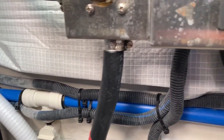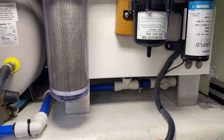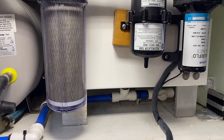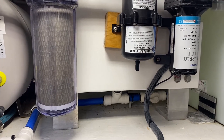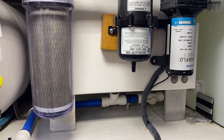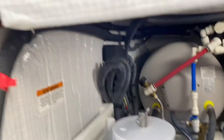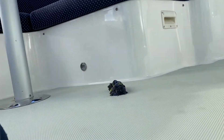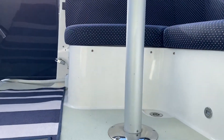It's a pretty simple system and it's one that you need to take care of and it'll take care of you. We do drink water directly out of the tanks — we use a water sweetener that has a little bit of bleach in it, and the tanks were very clean when we got the boat. We don't use the pressurized city water connection because we like to run as much water as possible through the tanks to keep them clean.